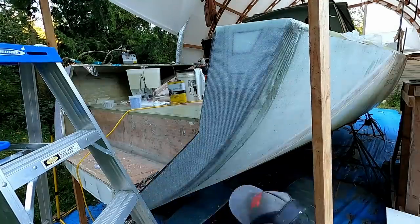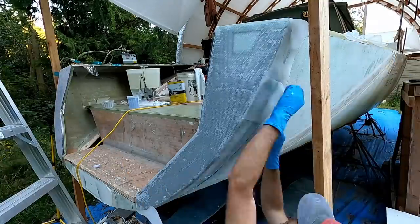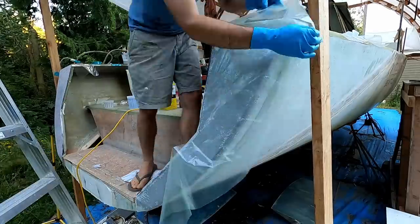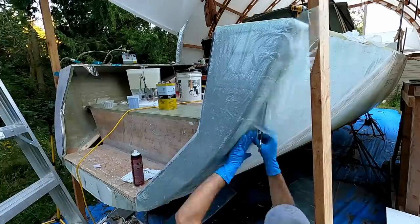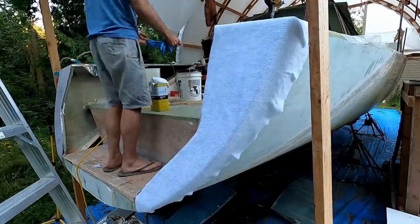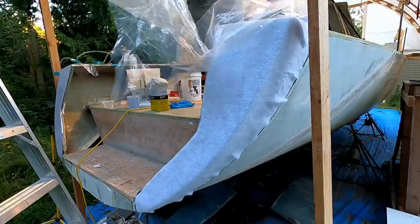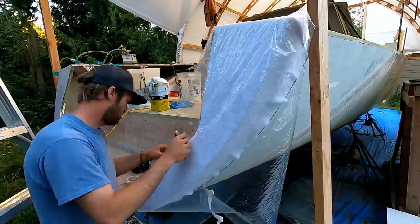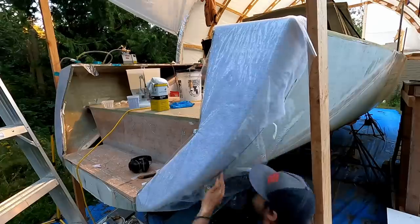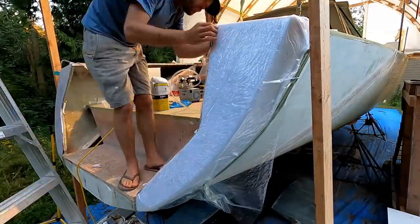The vacuum bag achieves a couple things. First, it compresses the glass down to be thinner than hand-laid glass. It also presses out excess resin. An ideal resin to glass ratio is 1:1. With a hand layup, I think a good ratio is more like 60 to 65% resin to 40 or 35% fiberglass. Getting less resin in the matrix obviously makes the part lighter, but it also makes it a bit less brittle. And lastly, it will help pull out any excess air that was trapped during the layup. And overall, it makes a more consistent layup because there is consistent pressure across the entire part.